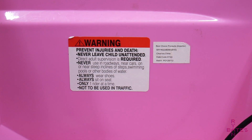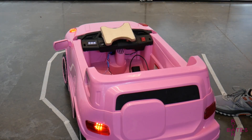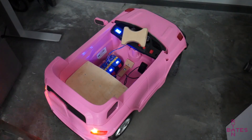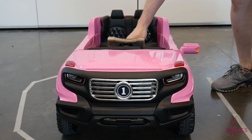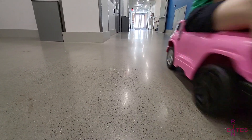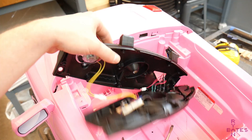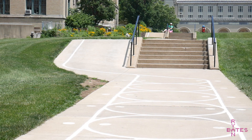The next item to address is this other sticker, which I think is because we're missing the features that make this car street legal. So I've added some indicator lights for left and right turn signals. These run off an Arduino Uno and Adafruit NeoPixel Jewel PCBs, which are seven addressable RGBW LEDs on each board. I've also added a safety car mode in case Formula One moderators want a faster safety car. The car also has built-in headlamps, so those were reconnected — they're just LEDs. Unfortunately the car only came with one side view mirror, so I upgraded it by removing the mirror sticker and putting an actual mirror in its place. Lastly, we need an audible signal, but horns are expensive so all I had was a buzzer, and I ran out of switches on the dashboard, so the gas pedal is now the horn. I think we're street legal now.